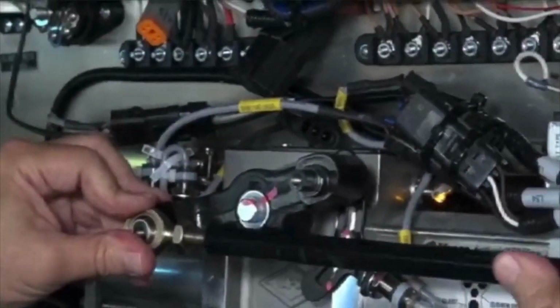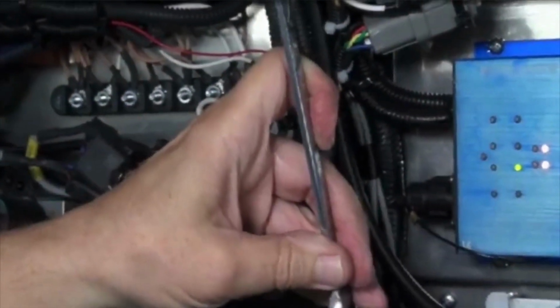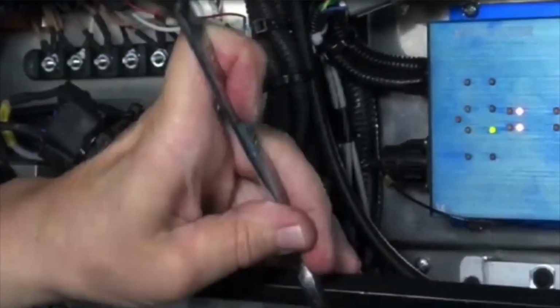Once the connecting rod is fitted onto the teeter bar, turn the rod again to move the door panel. As you turn the connecting rod, you will see the door panel move in the outboard direction. Once the rod has been turned by hand as much as possible, use a wrench to apply a little more preload on the door against the jam seal.